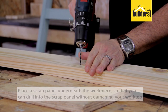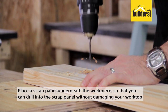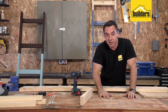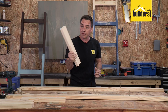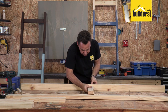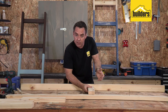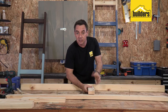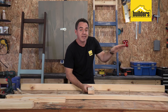When you are drilling, it's a good idea to put a piece of scrap board underneath. That way, you're going to drill all the way through into the board and not into a workbench or the kitchen table if you're working at home. My screws are all in place, and now it's time to insert the rungs. We'll flip that up on its side — the rungs are going to go in the center. You can measure and mark this and hold it in position, but it can be a bit tricky. I like to make use of some spacers under there, and that way I make sure each one is exactly the same.